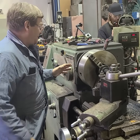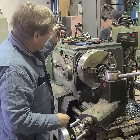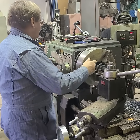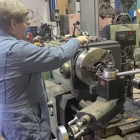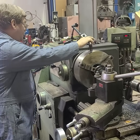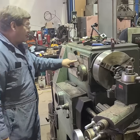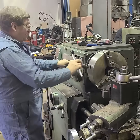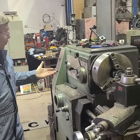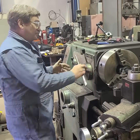When you're first starting out, put your part in the lathe, take your chuck key out before you machine — everything off. Be sure that it's off. Put this in neutral, and a lot of times you can do that even with the clutch running. You may want to move this to a different location and slide it into a neutral gear. Some machines — this one here has a neutral spot, but that's not the only neutral spot. It's actually a neutral spot between two gears here too; they just didn't mark it. A lot of your old machines will have a neutral spot between two gears that's not marked. They figured you're smart enough to know that's a neutral to kick it out.